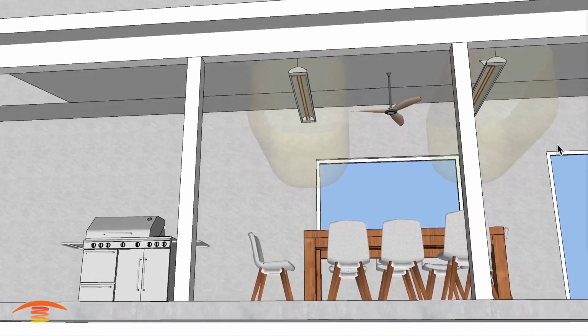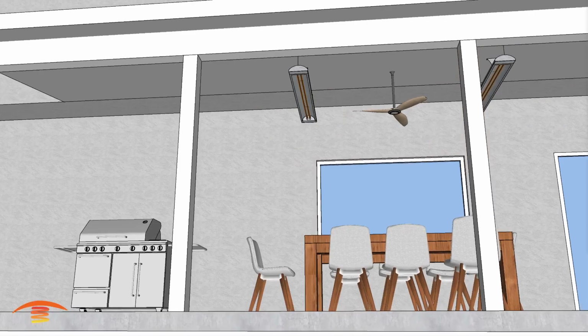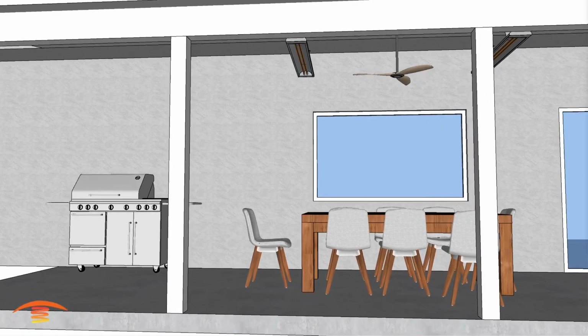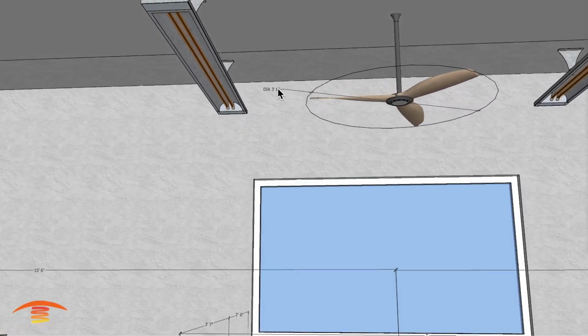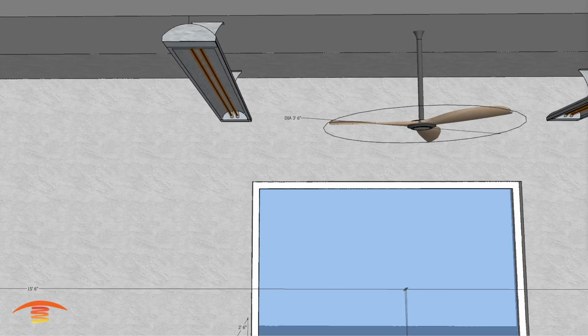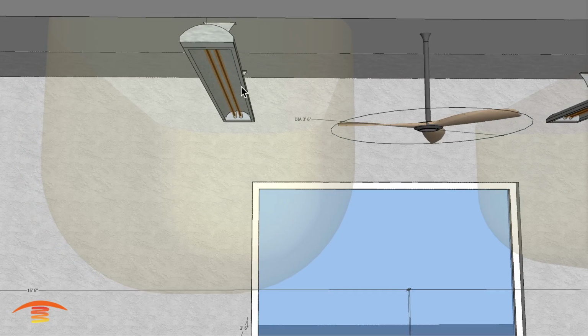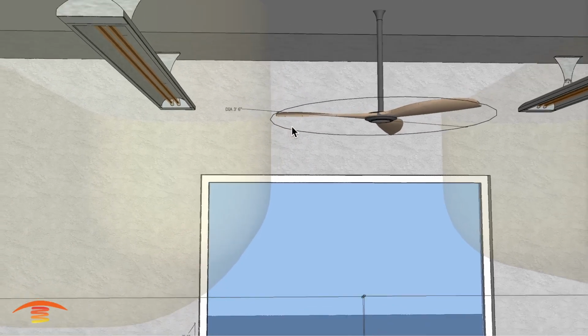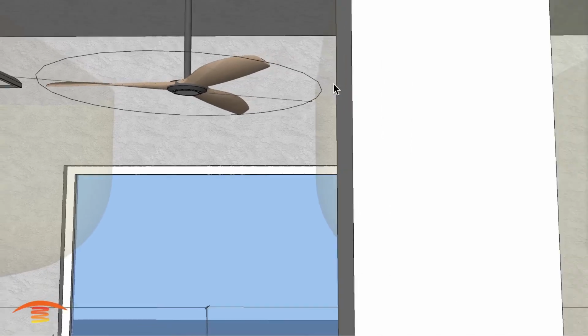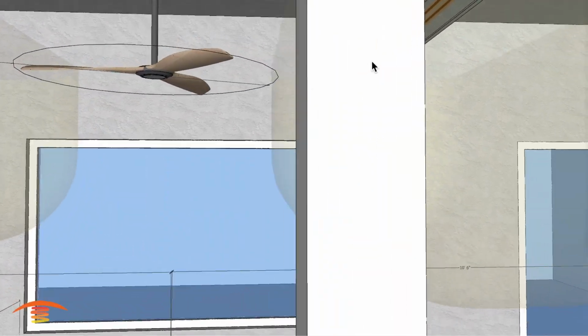And then I'm going to go ahead and turn off these clearances for just 1 second and take a quick measurement from center to center so you can see that information. So it's roughly 7 foot 2 inches from center to center. And then also let's go back to the diameter of the fan here. I have that again 3'6" diameter, and what we need to do is make sure we maintain a clearance below the heater at 18 inches. So from this edge here to that diameter, I have that at 18 inches from those 2 points. The same is true on this side here, from the left hand side of the heater to the right side of that diameter of the fan, I have at 18 inches.